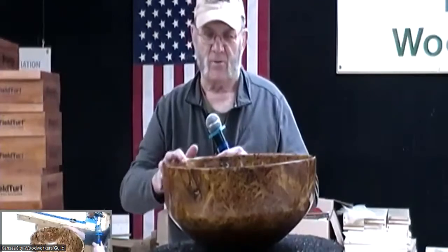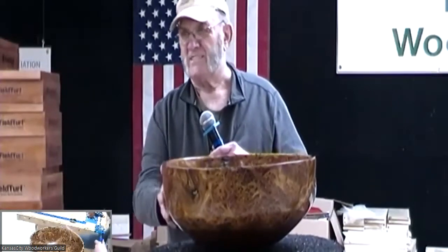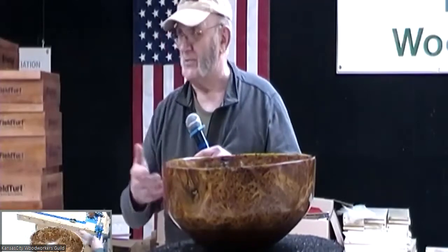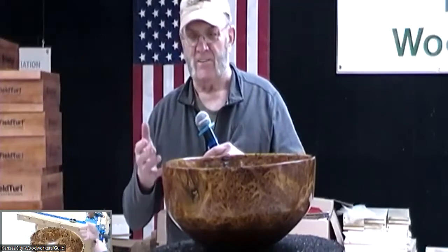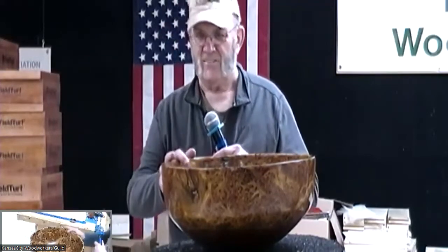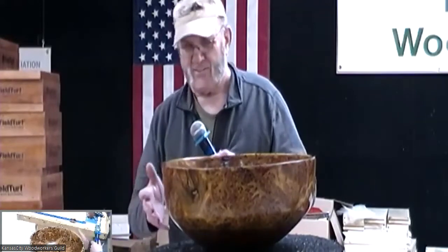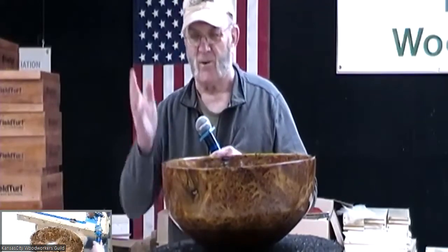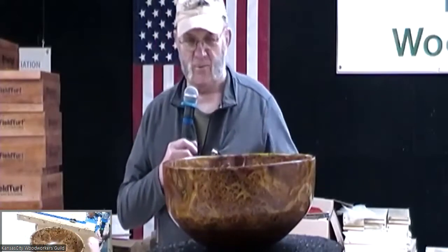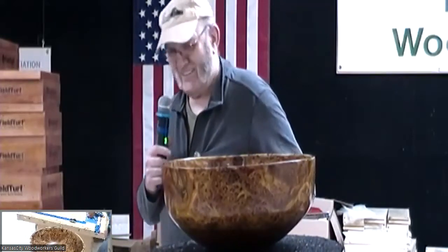And since it's turning, it doesn't run much. When you let this go for another day, then you come back, and now you get to sand and find out how uniform your coating was. After you've sanded, you start at 300 and go to 5,000, and then you put on the last coat, and after that's dried for a day, you come back and sand and go through the series, and then you get to buff it when you're all done. And when you get through this, you say, I'm not ready to do that again.